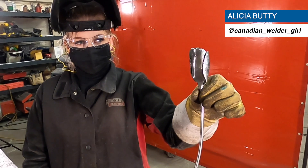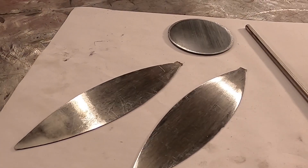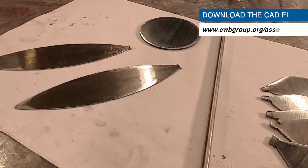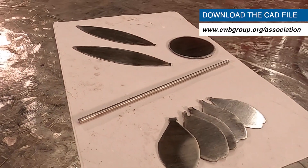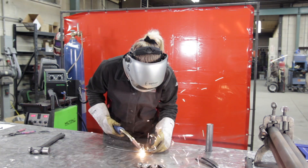Hi, I'm Alisha. I'm here to show you how to make a metal tulip. First, we'll start by reviewing the materials we use for the project. I've used 14 gauge sheet metal to cut my pieces. We're using 8.5 inches of 3/16th round bar for the stem. I'll be using .045 wire in my MIG welder today.